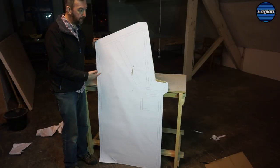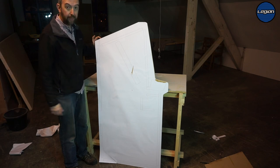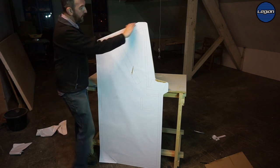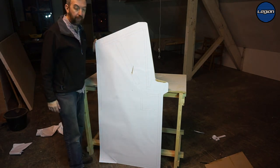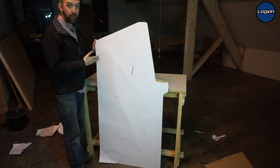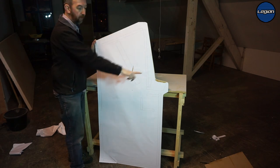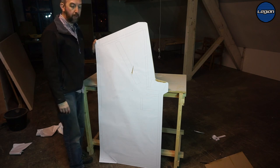So this is our template for an Atari Tempest Cabaret. Now that we've cut this out and smoothed all of these edges off, we can now use this as our template for our router when we use the trace bit, and we just traced around that top edge to cut out the plywood underneath. That will be the next video. Thank you for watching.